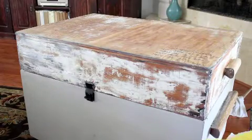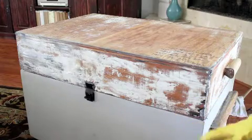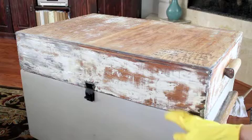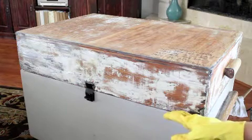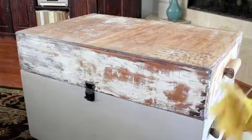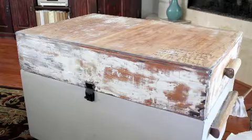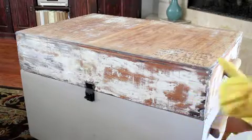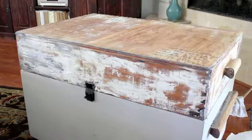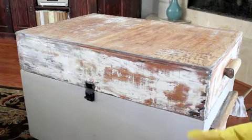I don't really want to cover up some of that white paint — I think it looks pretty impressive and interesting as is. Now, can this piece be restored? Yes it can. Do I want to do that to this particular piece? No. If this were an heirloom, sure, I'd keep going, applying more paint stripper. My personal preference is to continue adding stripper until it's pretty much seamless, because you can spend hours sanding whereas with stripper you can paint it on and walk away.